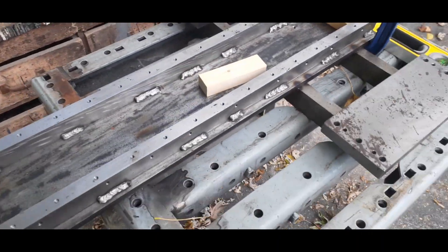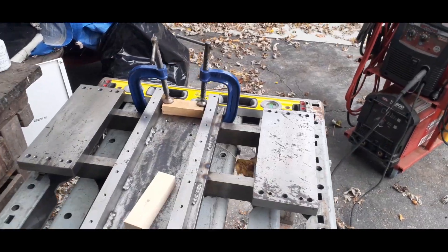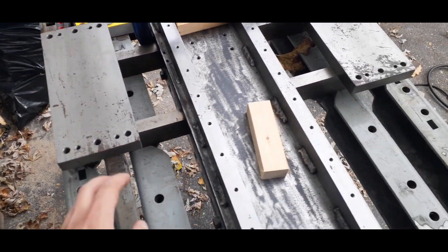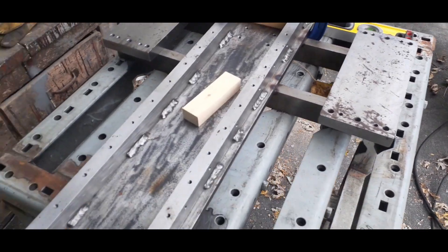So this is the main base plate — going to mount the linear rails on the surface, both of these two, and then the upper Y-axis C-axis assembly gantry is going to be mounted to these larger base plates. These will be threaded M12, and then there'll be a larger welded structure above that. This is a subframe.